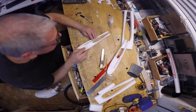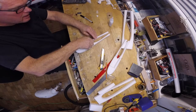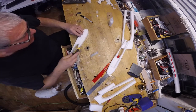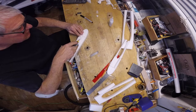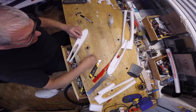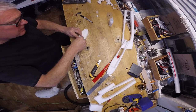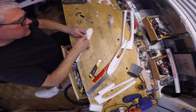Until we get in there. Okay, so we got that one done, 5/8 of an inch. Now, I'm going to cut kind of a checkerboard pattern. So what we're going to do here now is we're going to cut just a series of lines, and the same thing, just cut it almost through, about 3 lines works pretty good. And then on those 3 lines, very simply, we're going to take our blade and do the same thing. Put that depth down to the same 5/8 of an inch.